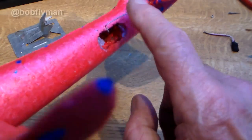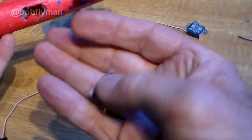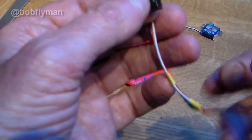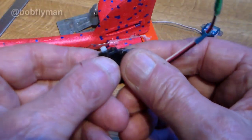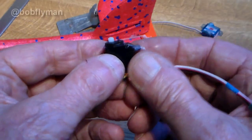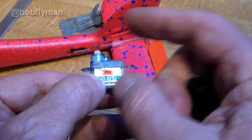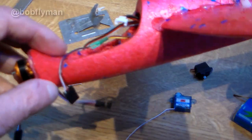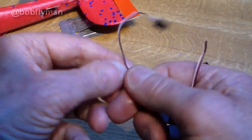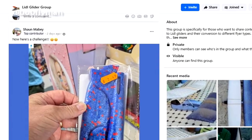Here's a top tip. I got the elevator all connected up, everything connected, then proceeded to test and discovered it only worked intermittently. Then I remembered - this was one I'd salvaged from something because it had an intermittent fault, and I'd put it in the box with my good stuff. Top tip: if you've junked something because it works intermittently, make sure you cut it off short and junk it properly - put it in the bin. I've got a couple of spare servos. This one is a 3.7g servo versus the faulty 2g one. Despite being slightly bigger, it's only 1g heavier. But bear in mind, for every gram you add on the tail, you've probably got to add about 5 or 6 grams on the nose - so it's still pretty annoying. I'm going to solder on an extension lead and then we'll try again.